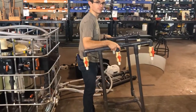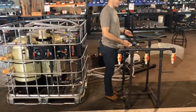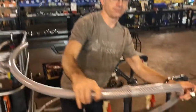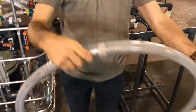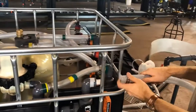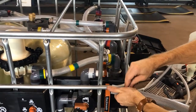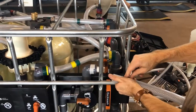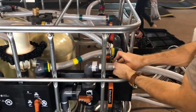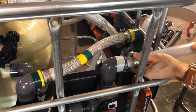Next, you're going to place the tap stand next to the treatment system. Usually it'll be standing in a half tank of water, but for purposes of this demonstration it'll just be on the ground. Then you're going to take the tube that's in the treatment system with the silver tape on it, and that will connect to the output on the treatment system. Make sure you put the hose clamp on before you put it on the spout, and place it on there firmly, using a nut driver to screw in the hose clamp.